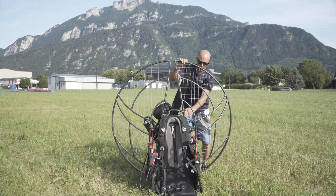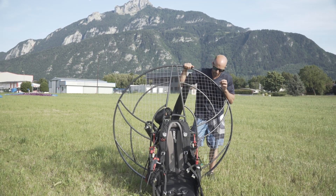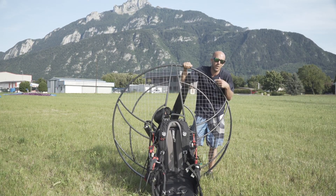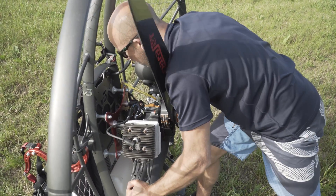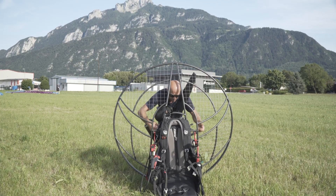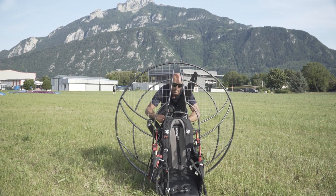I'm then going to come to my chassis which connects the cage. Check those connection points. Another little thing to do is just to look at the welds to see if there's been any damage because of a hard landing or transportation. I'm also going to come to my engine and give it a little bit of a twist while looking at the rubber engine mounts to see if there's any damage or deterioration and to ensure that they're nice and secure and attached to this back plate.